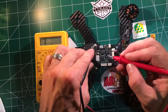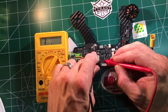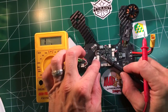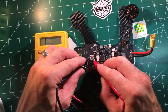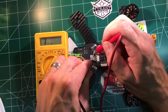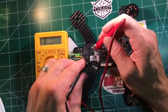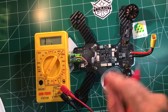Now let's say we did that and we're not getting a connection. So now what we can do — let's say we don't know what it is — let's take out this plug very carefully. Now the number two arm goes ground, five volts, one, two — so the number four wire. The number four wire into the harness is one, two, three, four — and touch here; should be zero. So this way you could check to see: do you have a bad cable or do you have a bad flight controller? In this instance we have a good connection — it's zero. So we have a connection from here through the wire to the pin, and we also have a good connection from the pin to the flight controller. That's how you would check the continuity of the components on your board.